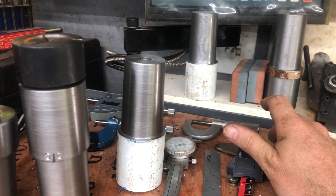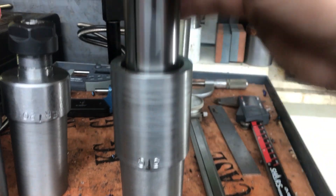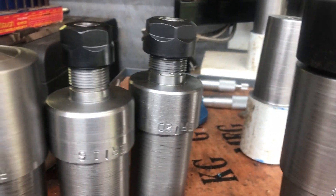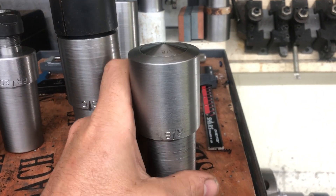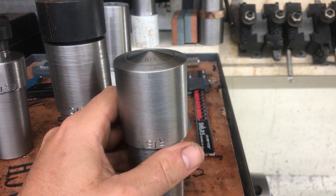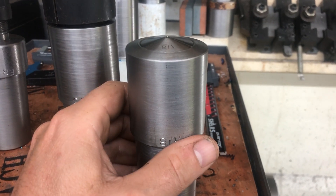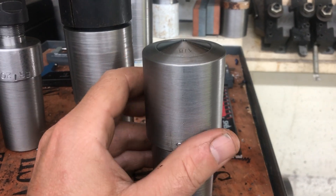I don't have ER11, 25, or 40, so I made one for 5C — and obviously it's got a disc collar. There's the mark on there: ER20, ER16. A lot of people would ask why use R8, and the reason is I have a full set of R8 collets for my mill, so why not have the extra option? If I'm chasing tenths and I have something previously machined, I could do that.